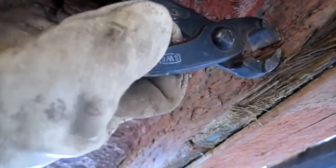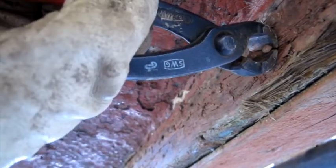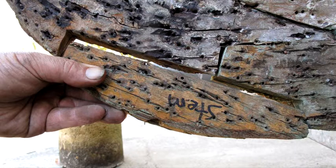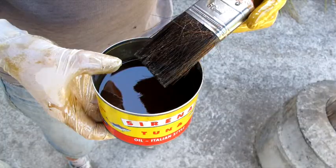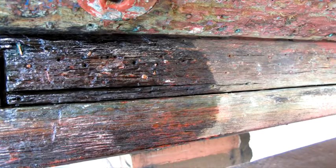The many copper nails which had secured the copper sheathing to the keel timbers were either beheaded and tapped in, or totally removed. At the stem and the cut water knee, all copper nails were removed. When this was completed, the timber had to be scraped and cleaned before successive coats of protective treatment were applied.